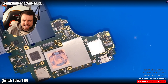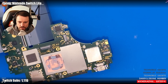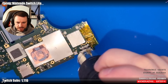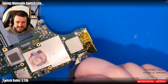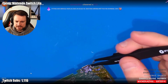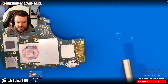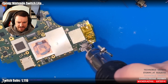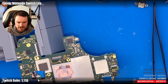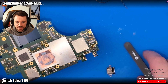This is the port — I think this is the one that he's taking off. You can see that he's put flux on it. We've already had a bit of an email exchange and Discord chat. What Chris does here is he heats from the top, which is absolutely fine — I know plenty of people who prefer that method. But I heat from the bottom, and then you avoid having to use tape. He's heated from the top, added a bunch of flux because it wasn't coming off. He keeps going. I think he's adding leaded solder at this point to the USB-C port to try to get it off. He's still trying to get it off from what I can tell. He's not got a microscope either — doing this without a microscope is just so hard. The fact he's doing it with just a normal camera is crazy.